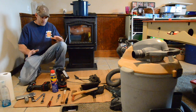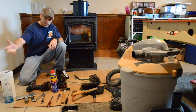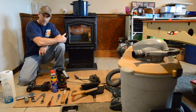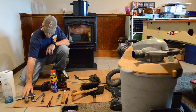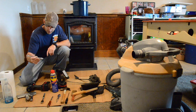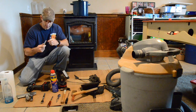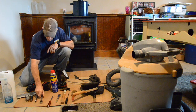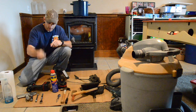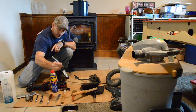These are some of the things you're going to need to make this job a lot easier. You're going to need some paper towels, something to clean your glass off with — they actually make a glass cleaner for pellet stoves, or some people use the ashes from their ash pan. You're going to need a bigger and a smaller putty knife, a six inch extension with a 5/16 inch socket — these are 3/8 inch drive. You could use a quarter inch drive if you have them. You'll also need a quarter inch socket with a four inch extension, a pair of pliers, a hammer, and a regular screwdriver.